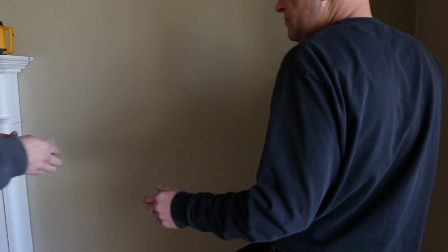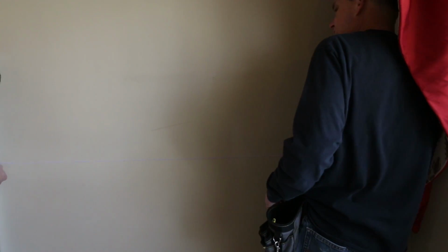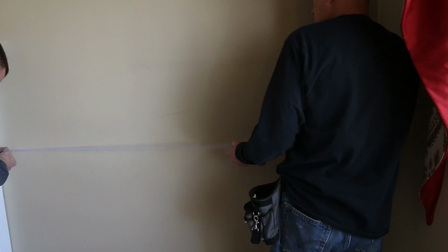They should have something. It'll leave zero residue, zero marks on your wall. If you use something like a red chalk, you'll be stuck with an indelible mark that might even need priming and painting to get rid of. So go with a dust away chalk. If you can't find dust away chalk, a suitable replacement is some talcum powder.